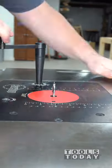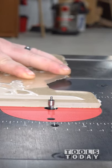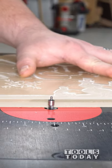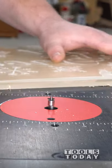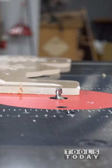I'm going to be using a plastic flush trim bit. This one is the 51436 quarter inch plastic flush trim bit, and it does a really nice job on this plastic — didn't leave any sort of melting, burning, chipping, or anything. Did a really nice job there.